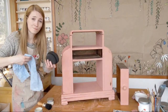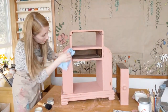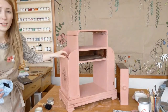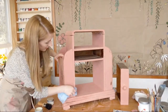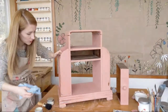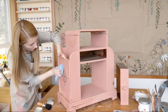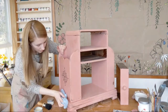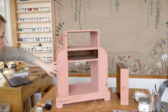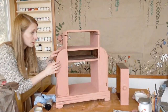I like to wrap the cloth up in a painting sponge — it makes it nice and spongy, still lint-free, and helps it spread around quite nicely. Already I can see a really nice shine. I worked it into the corners pretty good. I'm just going to show you how the antiquing wax works after I've applied natural wax on this corner and this side. There's a slight visual difference — this side just looks a little bit darker. The wax does its thing, giving it a little bit of a sheen compared to the matte paint.